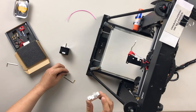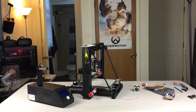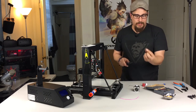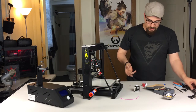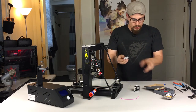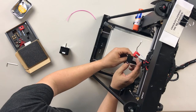You're going to want something that's around 10 millimeters — if you can get a three millimeter by 10 millimeter screw, you're in business. Mine happens to be 12mm, which is still fine; it's just going to slightly stick out the backside when it's fully tightened up. So get that prepped and ready so that we can slide our heater block in. We're going to sit that back on there and start putting our two Allen heads back into the bottom of the cooling block.